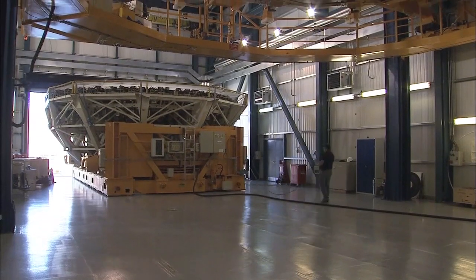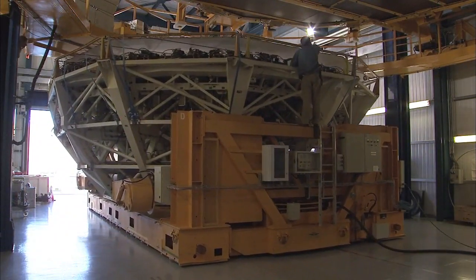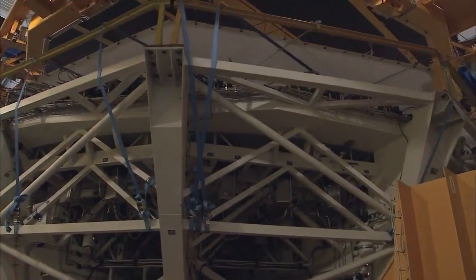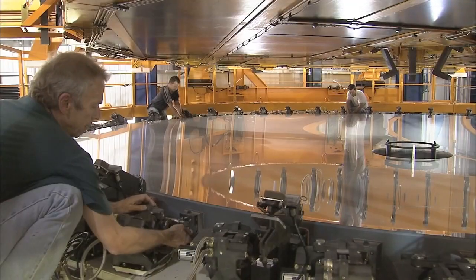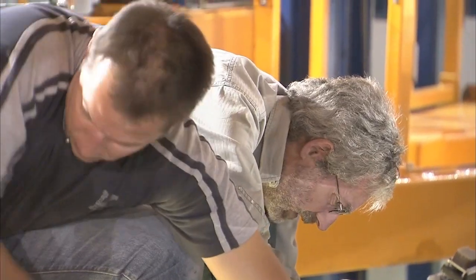But even at this walking pace, it eventually arrives safely at the mirror maintenance building. The first task at the mirror maintenance building is to remove the mirror from the carriage and its cell. The carriage is positioned under a custom-made handling tool. Brackets connect the mirror and the cell, and engineers have to release each one manually. This may sound like a routine job, but with the sensitive mirror surface only centimeters away, it requires the team's undivided attention.